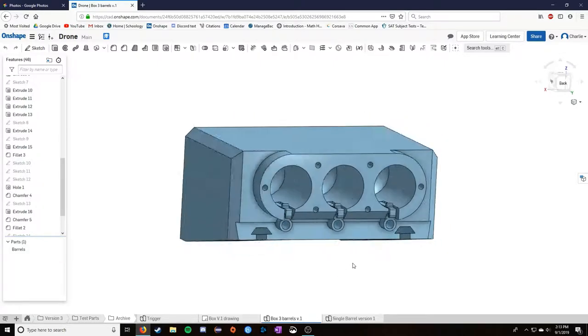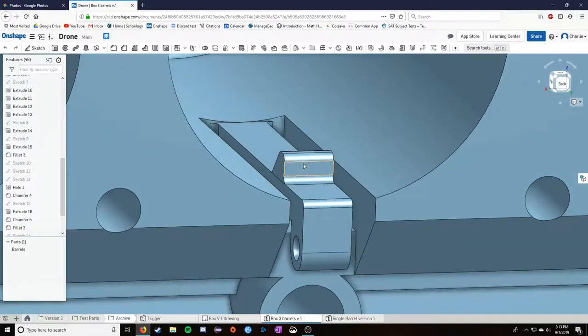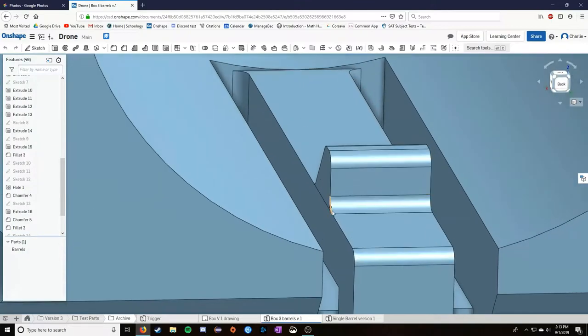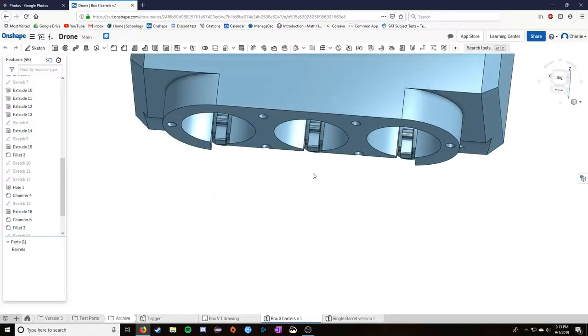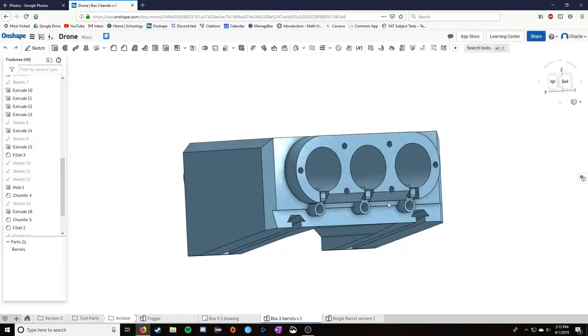So this model had a lot of issues going on with it, and on top of that, these were not big enough and not strong enough to hold the plunger back. It's fighting against a 6 or 8 pound spring, I believe, and that's just nowhere near strong enough. This tiny, tiny piece of plastic is a little less than 0.1 inches tall. So we're running into a lot of issues, as you might be able to understand here.